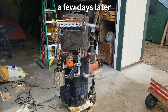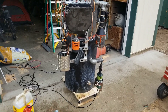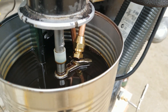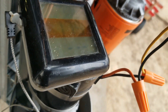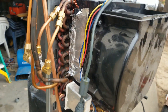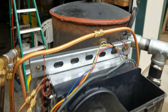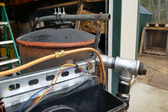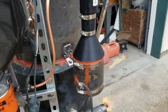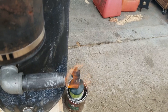Doing a run of the gasifier with the oil-cooled hearth and intake. We've got our oil pump right here, and the temperature is 179 — and that's after it has gone through the cooler. We've got some good warm air coming out obviously. Fixed a few leaks in the puff lid. We're operating in pressure mode so we shouldn't be getting air leaks. The flare is mostly invisible, but I'm pretty sure I could run an engine on that.